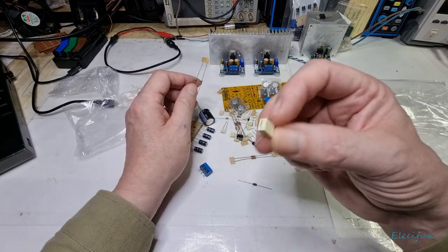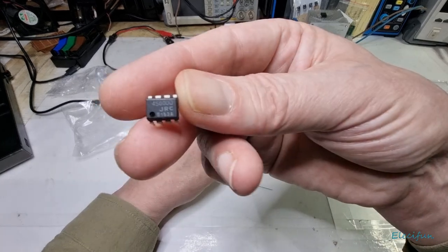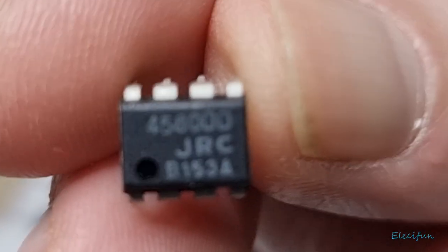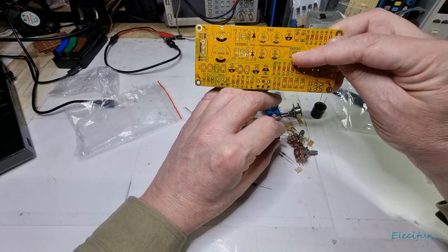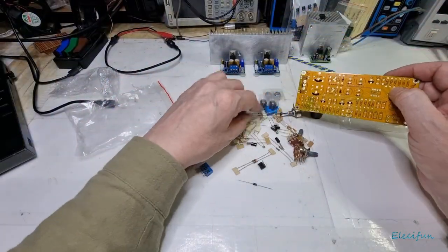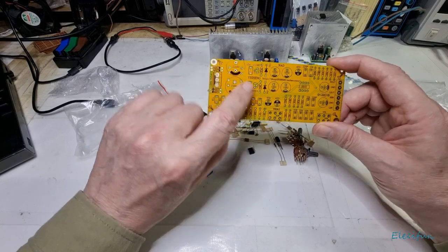I was talking to somebody about film capacitors and frequency ranges. This board is based around an op-amp — the NE5532. Let me zoom in on it. It's supposed to be an NE5532 — and yes, there it is on the op-amp package, '5532'. There is a socket on the board, and I have a couple of genuine RS Components NE5532s which is exactly what I'll be putting in there.